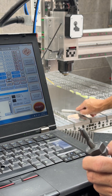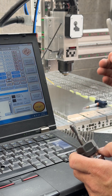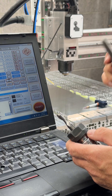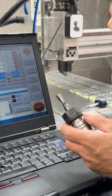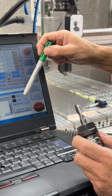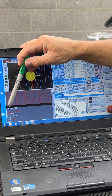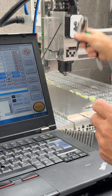I'm about to do my work offset, in this case at the top of my stock. This tip slots in well with my part one video on the QTC spindle solution from Techno Motor. It's very important to make sure the tool going into your spindle for the job offset is the tool that is current and active in your software. In my case it's Tool 10 — a 10 millimeter two flute — which is confirmed active in software and in my hand, ready to go into my spindle.